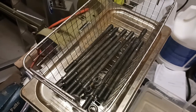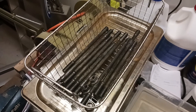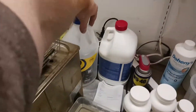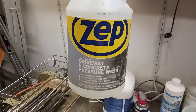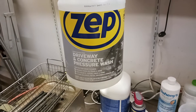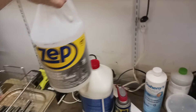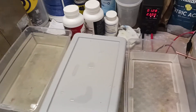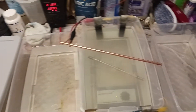And they start looking like this. These are the head studs. I clean them in this ultrasonic tank using this, which is the strongest cleaner I could find by the SDS. It's like seven and a half percent sodium hydroxide and a bunch of surfactants. Then I dip them in hydrochloric acid, and I do that back and forth a couple of times until they're clean.